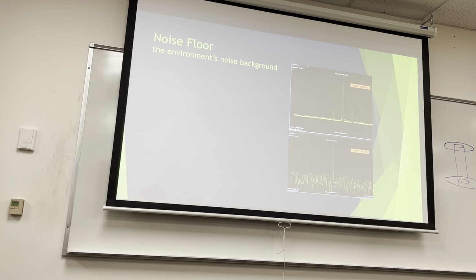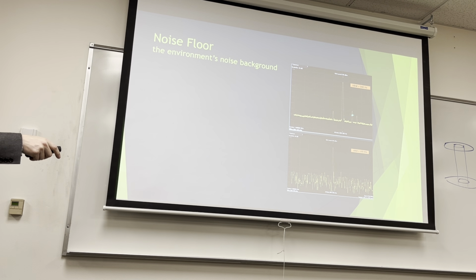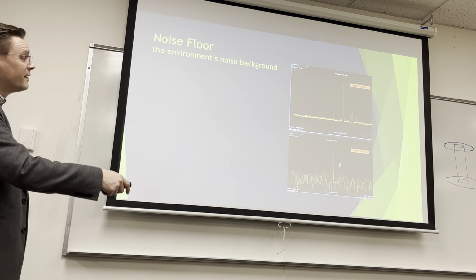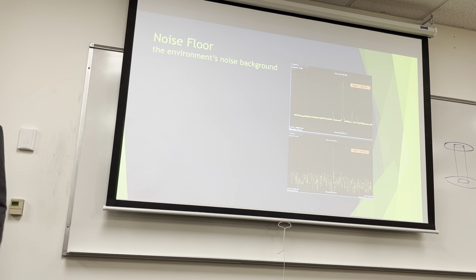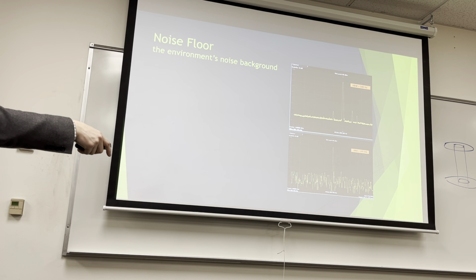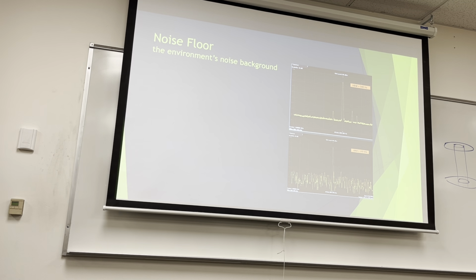And if we increase that to 100 kilohertz, which is about 30 times more bandwidth, right? Our noise floor rises a little over 10 dB. And you notice you have these little weak signals here, and you can almost not make them out now. In fact, this one you can see, actually that's noise, that's not even it. That's some other signal, that's not the same signal. Oh no, sorry, it's just shifted, sorry. But you can see these two signals, but these other two little guys here and here are gone. They're buried in the noise floor. And that's because we've set our bandwidth too high, we're scanning for too much.